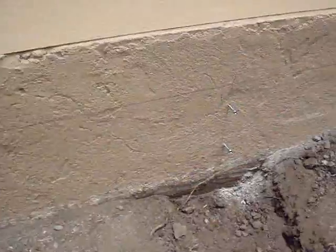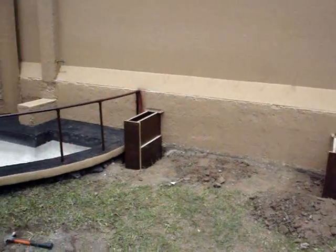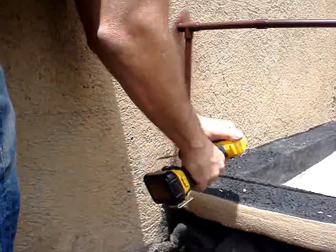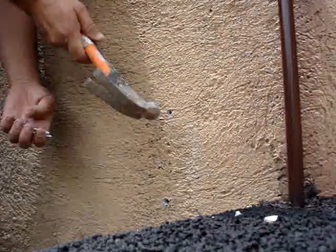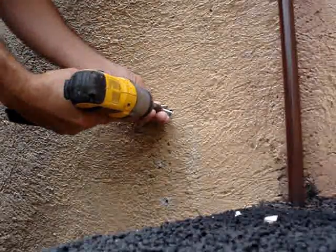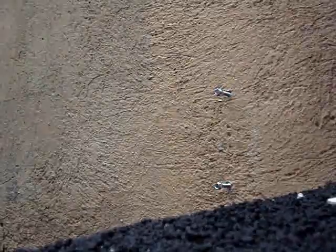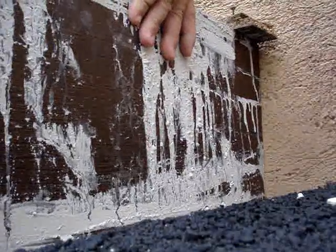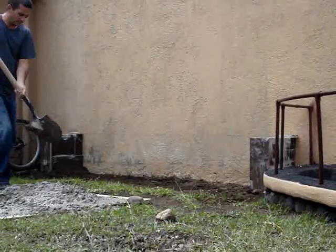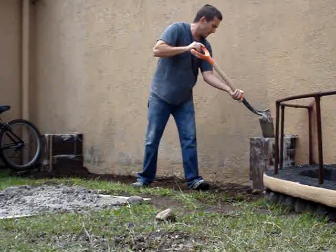Next I started the construction of the legs for the planter boxes. I inserted screws in the wall to keep these planters from being able to tilt sideways. I made some simple forms and installed the wedge anchors and some screws — this keeps them from tilting once the concrete is poured. The forms are only about 4 inches wide. I drew a pencil mark all the way across the wall at a level line, lined the forms up, and then filled the boxes with concrete.